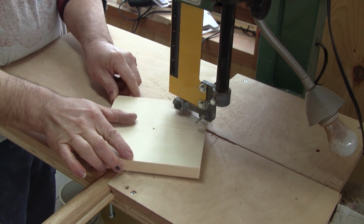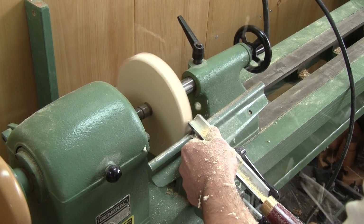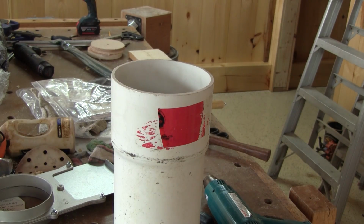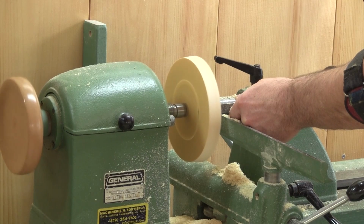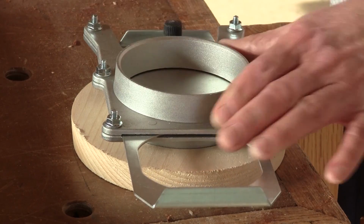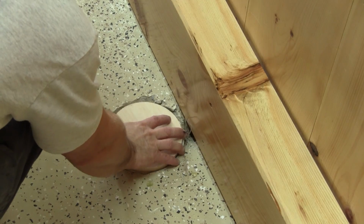I begin by cutting a circle on some of the wall strap pieces. The circle is bigger than the pipe. This is expected. Now with my new lathe, I'll turn them round. With its taper shape, it fits perfectly. On one plug, I make a 4-inch hole in the center. This is for a 4-inch blast gate. Then I can plug 5 of the 6 dust collector holes.